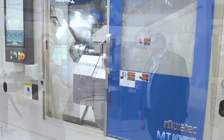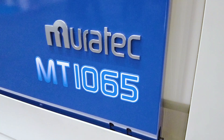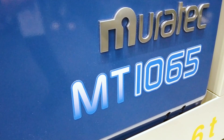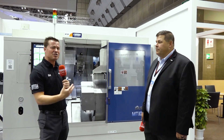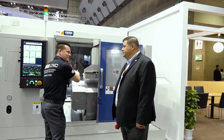Jeff and I are in Japan today, so excited to be here and we want to talk about the MT-1065. A lot of you out there might already know the concept and idea of twin-turret, twin-spindle — not calling it sub-spindle anymore — same type of power, the ability to pinch-turn, do multiple operations inside of one machine so you can have a smaller floor space and do more instead of going from machine to machine to machine. These are all the details when we talk about this style of technology.